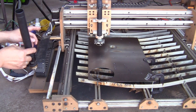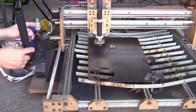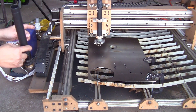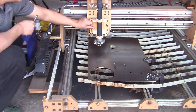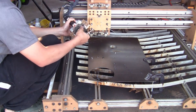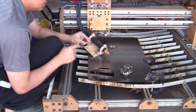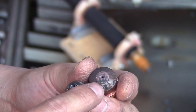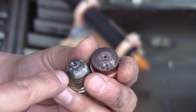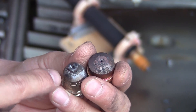So what I did is replace it again with an A141 torch that can handle current up to 140 amps. You're probably going to say that I overkilled it, but in my defense, a torch built for higher current means that when I cut at lower current, the nozzle won't melt as much, so the consumables — the nozzle and electrode — will last longer. I've been using the same nozzle for more than 10 cuts now. If you scrape off all the slag that got stuck on it, you'll see the nozzle looks almost as new, whereas the P80 torch nozzle was completely melted on one side after about the same number of cuts.